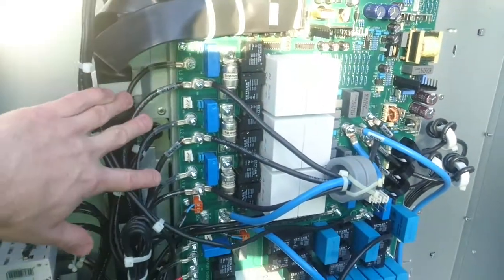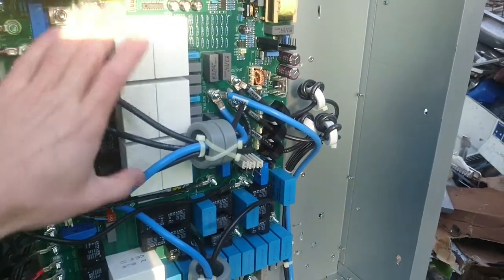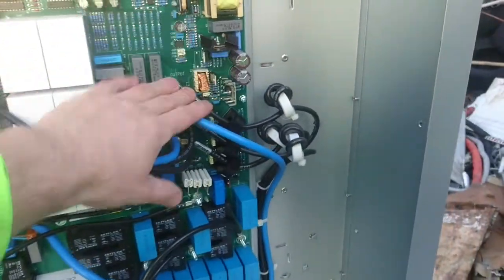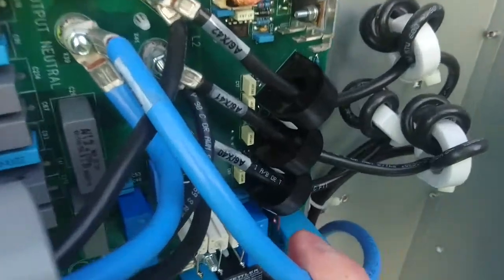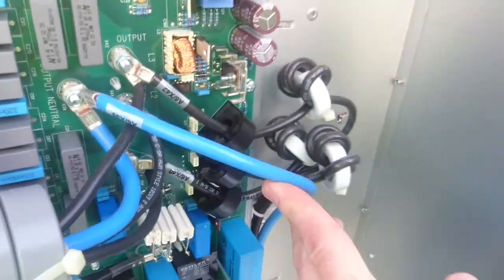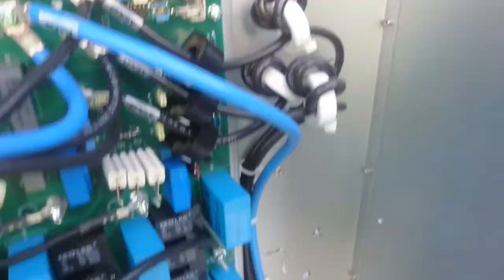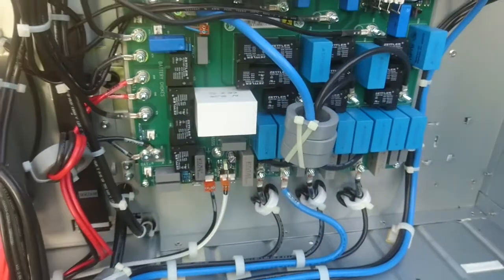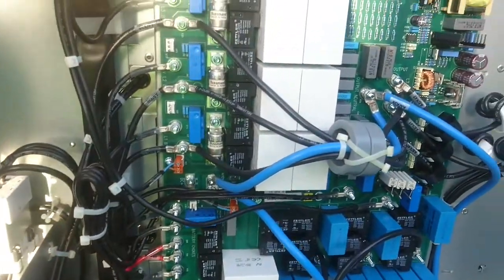Up here we have all the inverter L1, L2, L3 phases. By these relays — also with heavy snubbering for filtering and large chokes — this can all be bypassed and run through the output down to the output terminals. We have output current sensing from three hall effect sensors, or maybe these are just regular current transformers — that differs from unit to unit. But other than that, this mainly is just a filtering and distribution board with all wires running into the unit to the modules behind.